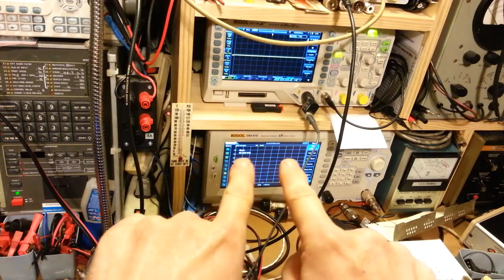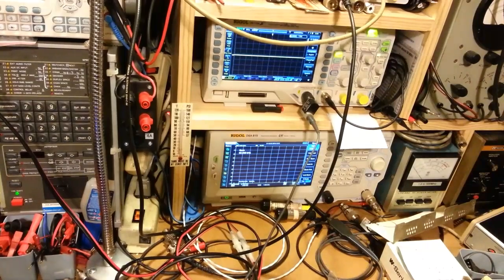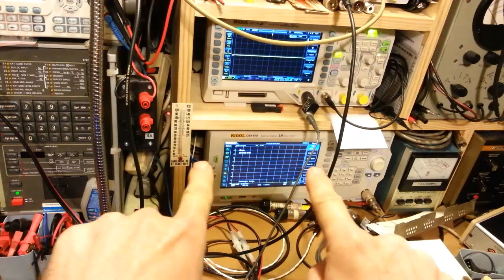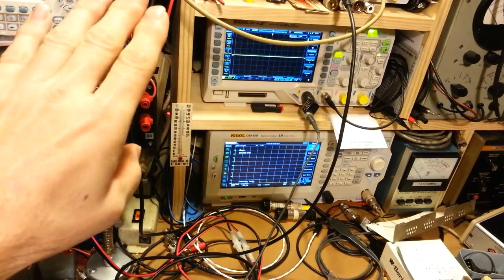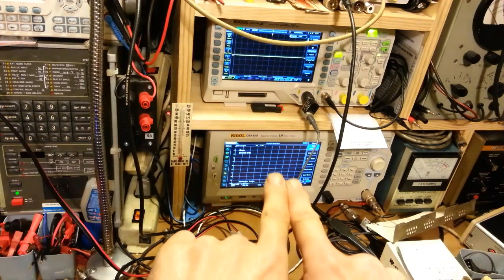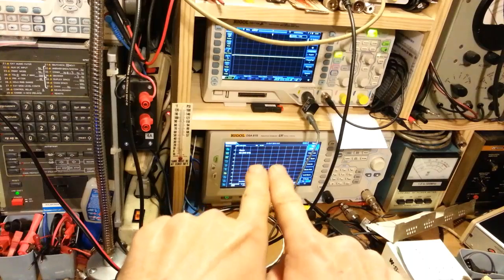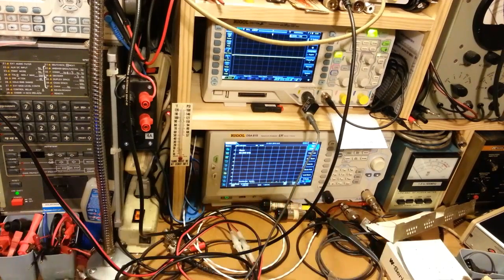So you'll see those side bands actually move out, because we're using the signal generator up there. We're going to be sweeping from 10 hertz to 25,000 hertz over a period of 5 seconds. I have the sweep time set to 5 seconds. So you'll see those 2 side bands move out. Now with a 25,000 hertz maximum audio frequency, that'll come out just to the outside edge, because we have the span set to 50,000 hertz. So 25,000, because there you have an upper and a lower sideband. So you'll see it sweep out.